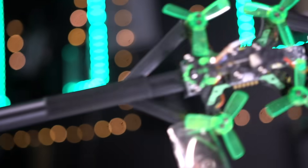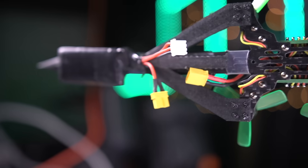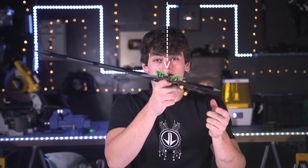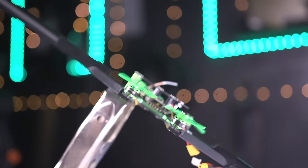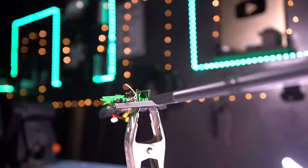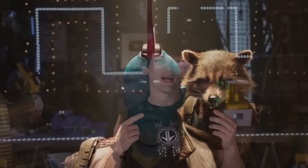I basically printed the back end way more dense than the front. I also put the battery back there along with some counterweights, so now the center of gravity is right over the propellers. I also tried to model it slightly after Yondu's arrow with the sloping front and back end. It was a little on the wide side, but if I saw this I would still definitely think it's an arrow. So the last thing we've got to do is make it fly when I whistle.